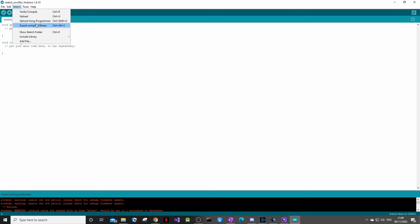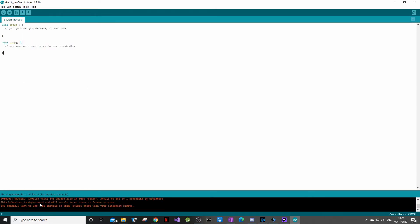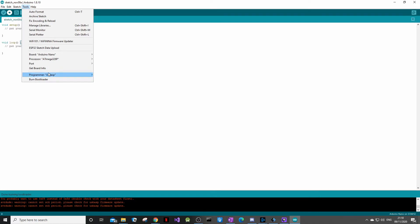I should clarify — this is actually not putting on the Arduino bootloader; this is programming the chip via ICSP. The bootloader you put on separately so you can use a USB cable to program it. To do that, it's very simple — just go to Tools > Burn Bootloader. This will put the bootloader on your chip so you can then use it as a normal Arduino with a USB-to-serial converter. Upload Using Programmer takes code and puts it directly on the chip; Tools > Burn Bootloader puts the Arduino bootloader on the chip.